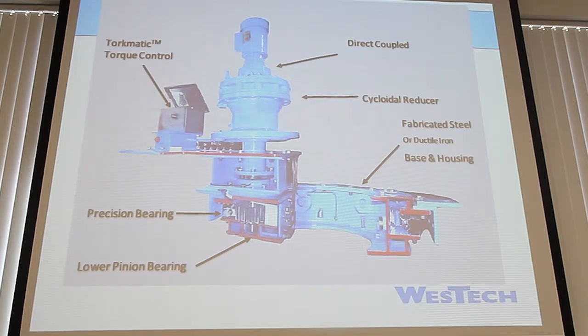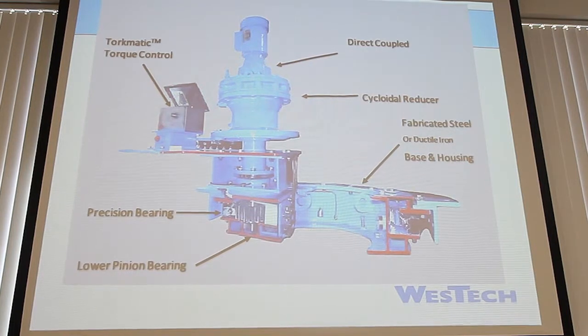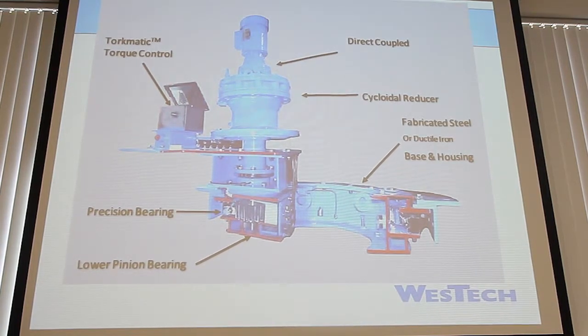That's how we've been doing our drives for 40 years. It gives a locked raceway, and really helps to distribute the stresses from the hanging weight and the overturning moments properly back into the drive. It really adds life. When you have strip liners, a lot of the time you'll get unbalanced loads that run on the ball bearings, and sometimes 3 or 4 bearings will get all the weight because it doesn't distribute properly. Having this precision bearing locks everything in and distributes those loads a lot better.